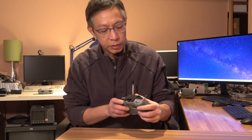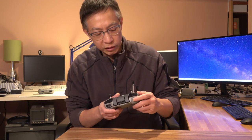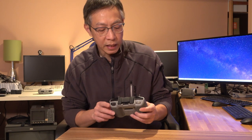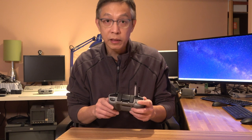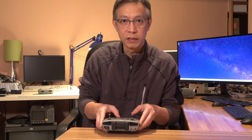I was doing some research, going into all the forums, and seeing the discussion. The problem actually already happened a couple of years ago, and DJI obviously already knows that, but up to now they still don't have a firmware fix. So the gimbal wheel design is probably just a potentiometer inside. Hopefully there's some wiring inside we can reverse to make push tilt down and pull tilt up. I'm going to open up the remote controller today and see what's inside.